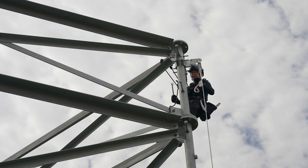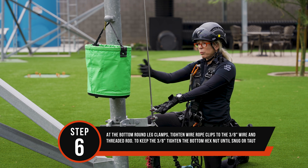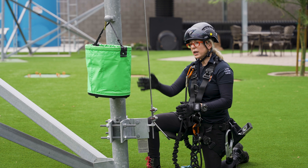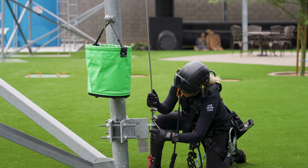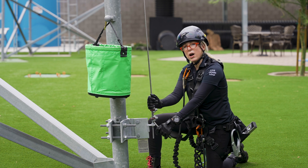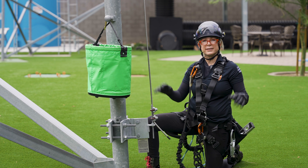We've put our bottom bracket on, put our top bracket on, and run our wire to our travel aid system. All the bolts are evenly placed, snug and tight, top and bottom. Now we need to tension the wire. There's a little bolt at the bottom — as you tighten this bolt, it will increase the tension on the wire. You want it snug and taut. Once it's in place, put your wire clips on and fill out the tag, and you're done.